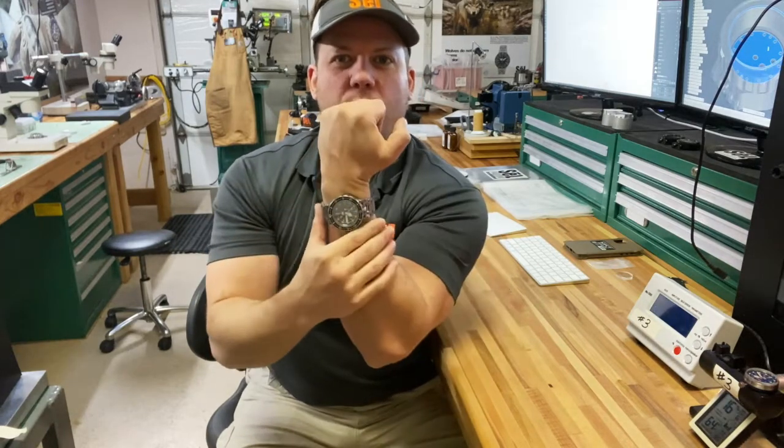But the people in our focus group said that the competitor's watch looked more aligned than ours. I think the reason is their noon marker points down, so the bezel triangle is pointing at the flat backside of the noon marker triangle. Because it's such a big flat surface, you have less visual reference on that alignment, and the effect of perspective is less as well as you're angling the watch slightly. The lack of two points pointing at each other as a reference gave the perception that their alignment was better than ours, even though ours was actually three times more accurate.